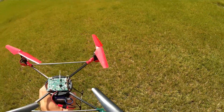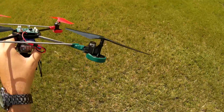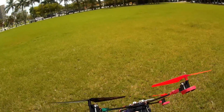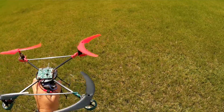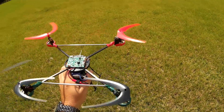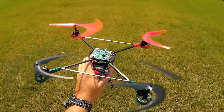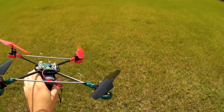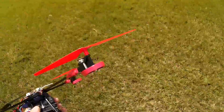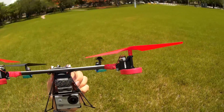I'm losing power on the rear right. That's a motor that has never burnt — it's been kicking for months already. Kind of a good sign that's the one that burnt. This is clockwise — I got two clockwise, let me double check. Accelerate — yep, there it is, it's failing. It should be kicking hard and it's not like the others. When you turn it you can feel how hard the others kick — this one is barely holding it up. Almost dead — officially that motor is dead. Let's kill the power and call it a day. At least I got enough flight time and hover time to see how this thing behaved and how the vibration dampener worked.